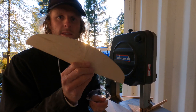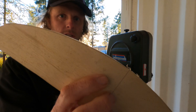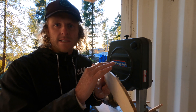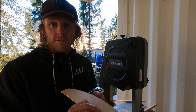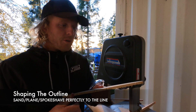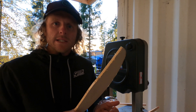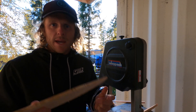I've just finished cutting out the outline on the bandsaw. I tried to cut it as close to the line as I can, but it'll always wander a little bit. The neater you get it, the easier this next step will be — and that is to sand this outline. We want to get the outline pretty much exactly perfect as it will be the finished outline, the very edge of the foil. You can use a spokeshave and a plane, an orbital sander around the edges, but the way I like to do it is use a belt sander clamped to a bench on its side. I'll set that up and then clean these up.